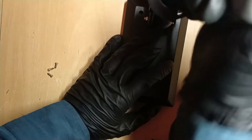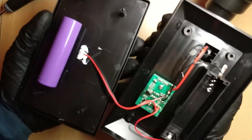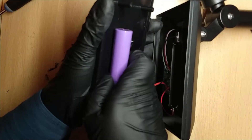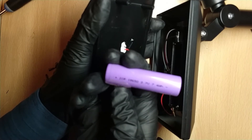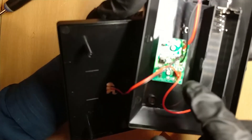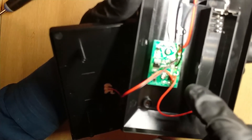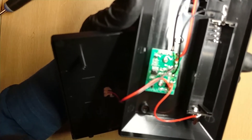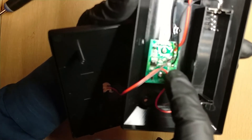The solar cell is glued to the lid, which is unusual. The cell is marked IRC 18650, 3.7 volts, 7.4 watt hours — that's 2000 milliamp hours. There's a chip with some kind of conformal coating on it to stop corrosion, which is a good thing, but it also prevents me from reading the chip number. The coating is a bit light on one side but the rest is covered quite well. It could be a standard bike chip, which would explain the SOS and different brightness modes, plus additional circuits to stop it working when the solar panel is on.